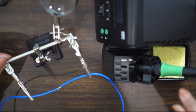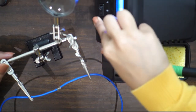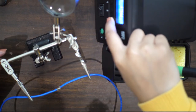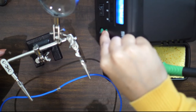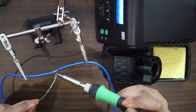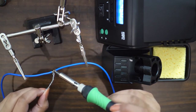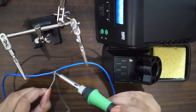Now let's look at common mistakes during soldering. Number one: set the heating temperature to the optimum level — just sufficient to melt the solder for the joint. Do not heat up excessively, as higher temperature means higher risk of oxidation. Second: the soldering tip should be clean. A rusted tip will not transfer heat properly. For cleaning, you can use either a damp sponge or copper wool, and use distilled water for dampening the sponge.